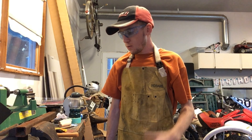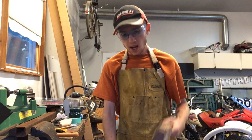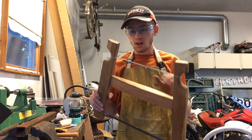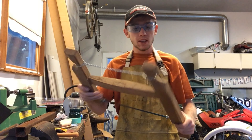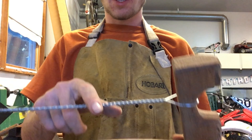The angle grinder didn't cut through all the way because of my shortened blade, so I'm going to use a hacksaw. But the hacksaw I had broke — the tensioner wouldn't tension anymore because the frame was bent — so I made my own. This is equivalent to an old bow saw; I just put a hacksaw blade in it and made this completely out of firewood.